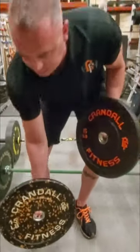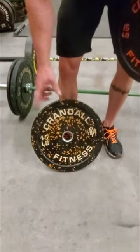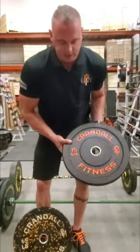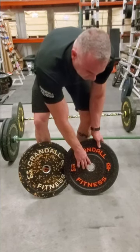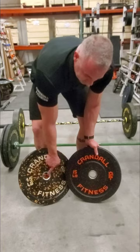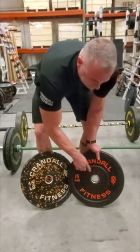Also, these smooth ones use a hook center ring — the center ring is put in and it has hooks that come out of the middle, and the melted rubber is poured around it. The crumb bumpers have compressed center rings: the ring is put in after the bumper is compressed into place and squeezed in there. Because they're made of compressed rubber, you can't use the same hooked rings since they can't be inserted afterwards into a compressed rather than melted liquid.